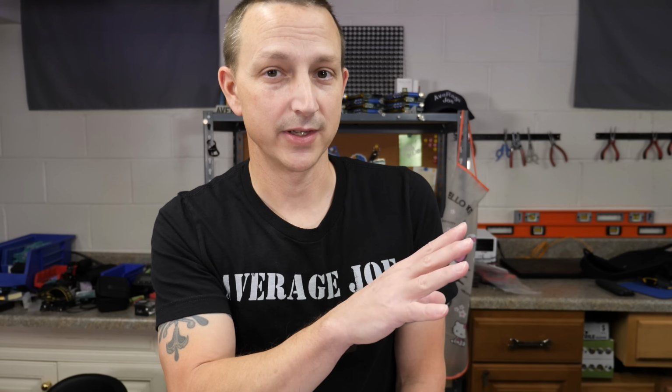Oh, there's one other thing I forgot to mention: Zendure is sending me out one of their Y cables. Pretty sure what that allows you to do is actually get 240 volt split phase out of this unit. If I didn't mention it earlier, that 240 volt plug on the front is not 240 volt split phase, it is just 240 volts.